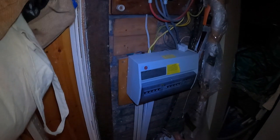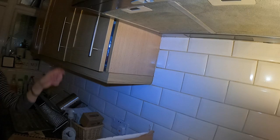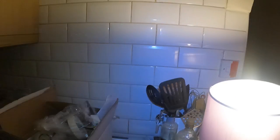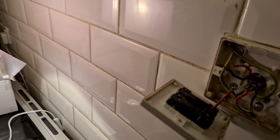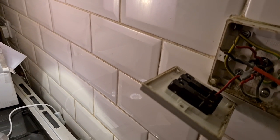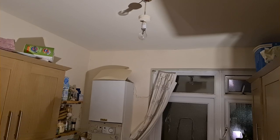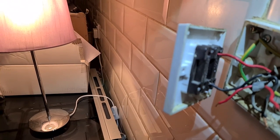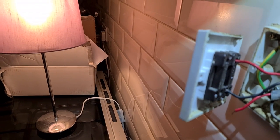You've got a new fuse board — it's plastic, about eight to ten years old. There's a new light for here and one for the kitchen. There's a pendant for the hallway — nothing wrong with that one as far as I know. Let's see what we can do. That black and that red — that's phase and switch line for the light up there. So when I connect it to one of those switches that should work. I've connected the switch line and the phase, which should have red sleeving or brown sleeving on it.